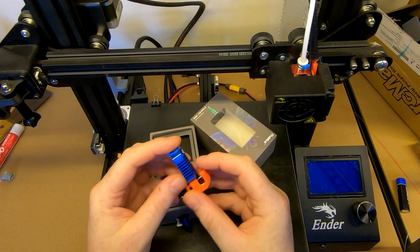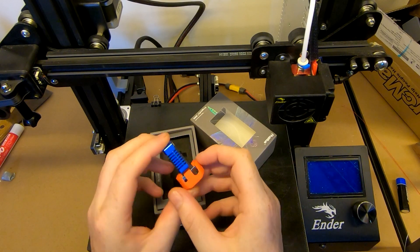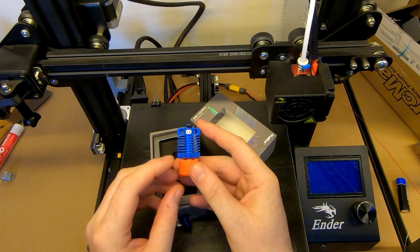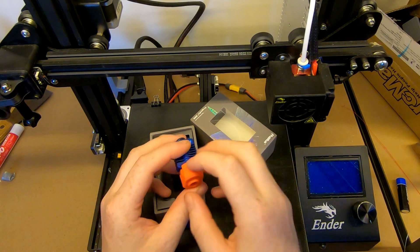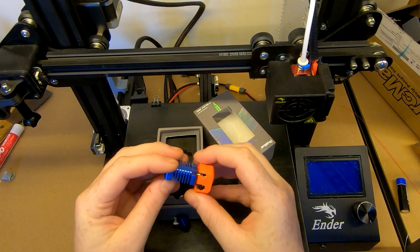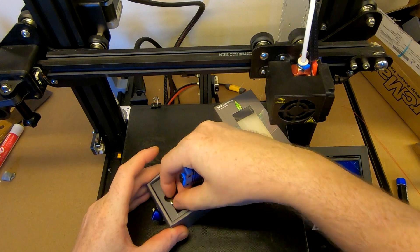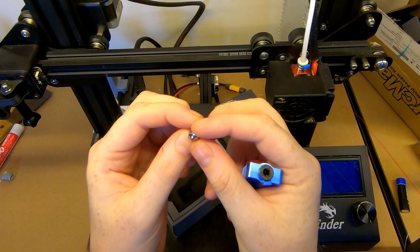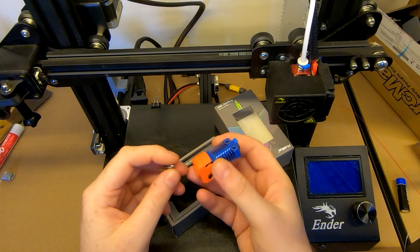As you can see, it's got a nice blue heatsink with a silicon sock, which is nice to see. A lot of companies now don't actually include silicon socks and they're expecting you to just run them with nothing. I like to use a sock not only for better thermal properties, but also if you get any plastic curling up, it's less likely to get all over your nozzle if you have a bit of an accident. Very solid piece of unit, once again a full metal hotend. The nozzle — I believe it's plated brass, but we'll double check that and have a quick look in the manual.